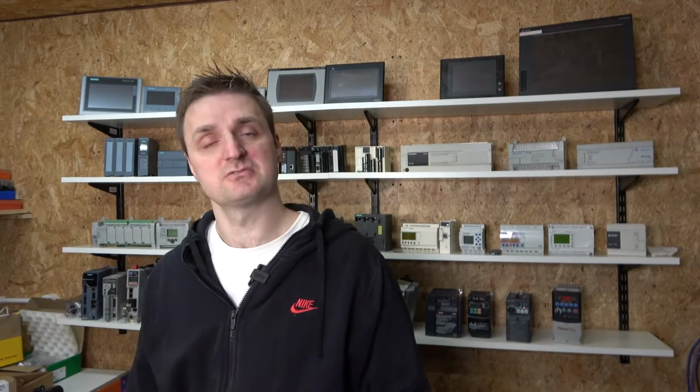Today we're going to be looking at setting up analog output for our ATV320 drive. The reason I'm making this video is that it's a little project I'm working on, and one part of it is for the next video: setting up the analog output to output 0 to 20, or 4 to 20, milliamps. I haven't decided which one I'm going to do yet, and I want to show you how the ATV320 output can be set up.